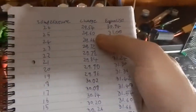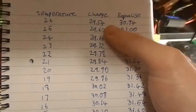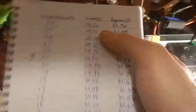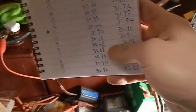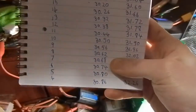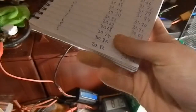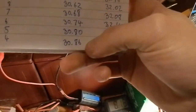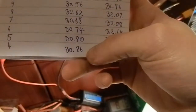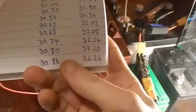That's very problematic, because at 25 degrees you may have charged a 24 volt bank to 29.6 volts. I've got a full spreadsheet of this which I'll put in the video description to help you. But when they're really cold, you may need over 30.86 volts to charge them, and even higher still to equalise.